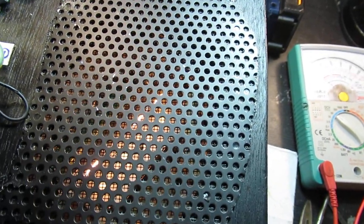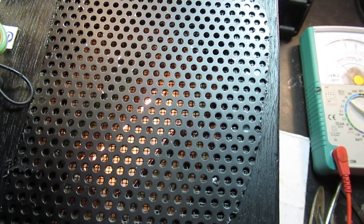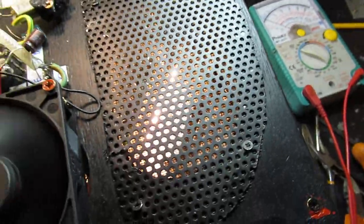It's a halogen lamp that's used as a kind of protective resistor, and when I lift up the output you will surely see that, say, at the output we have a kind of shortcut in the form of these 4 lamps, and this resistor now takes up the heat. All of course according to Ohm's law, and that was also in an earlier video.